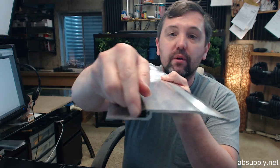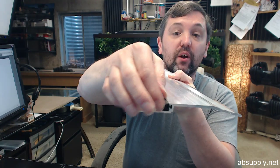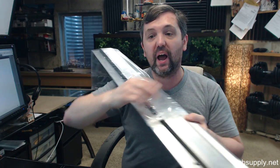So if the door doesn't have a constant margin between the face of the seal when it's closed up against the bump up, between the hinge side and all the way over to the lock side, that finger that projects out a little bit further will make that contact required so that there's really not a void. Without the finger, and you had only the bulb, any sort of misalignment like the jamb leg being toed even a minor degree, even tipped in or out slightly, will really take that door and tip it in or out, making it hinge bound or making it spring forward. So that finger helps compensate for that sort of application.